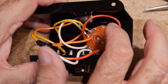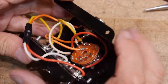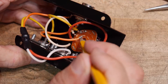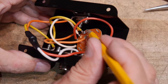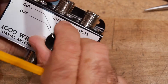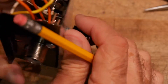It's a dual pole 4-way switch. So what I did was make something to point with. This is Antenna 1, Antenna 2, Antenna 3, and then this is the output here that's on a common commutator. And then this is the off position. So I put a link in here so that these two are shorted together, so either output 1 or the off position both select Antenna 1. That's going to be my main antenna, so I can crank it all the way left and I'm still at output 1 — no chance of having it open.